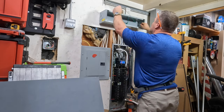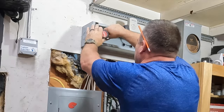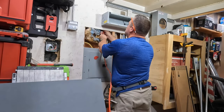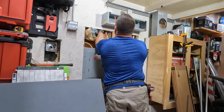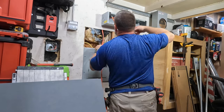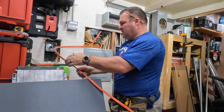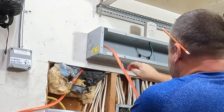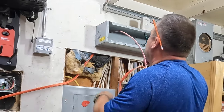I'm thinking about what to do with this ground wire — I'm going to drill and tap a ground bar inside the enclosure. I also forgot to make a knockout for the generator wiring here, and once I did that I put the connector in and was able to access it through that hole. I'm able to bring my generator wiring through the back of the six-inch trough, and the generator wiring eventually goes to the box on my left, which goes to the outside near the garage side.